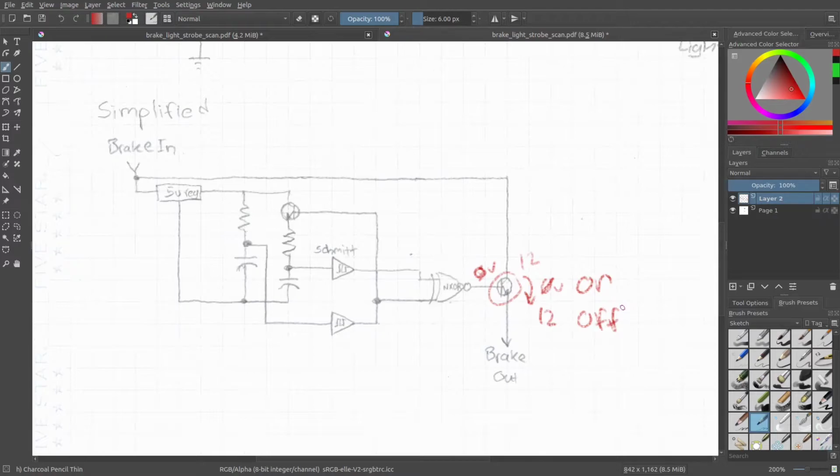So you take a step back here, and then you have the inverted exclusive OR gate. What this does is basically when you have a 0 and a 0, or a 1 and a 1, the output is 1. If you have a 0 1 or a 1 0, then the output is 0. Simple truth table stuff.